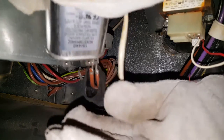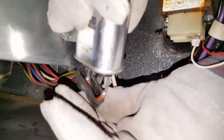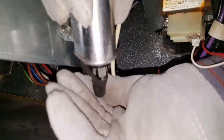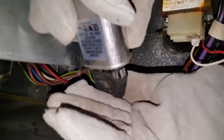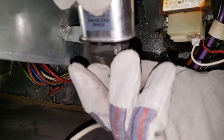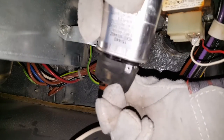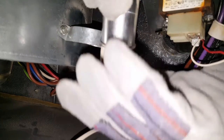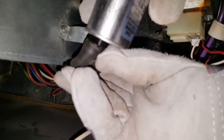I am attaching that lead back onto there, attaching the other lead, and bringing down the rubber insulation to make sure those terminals are not touching anything. I want to make sure those terminals are properly insulated and not exposed on the outside — not at all.